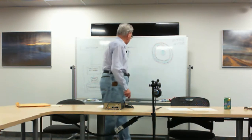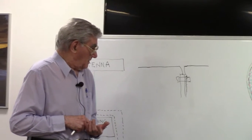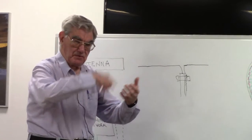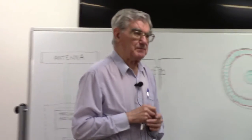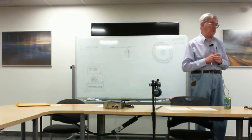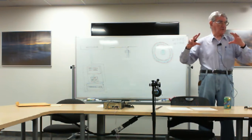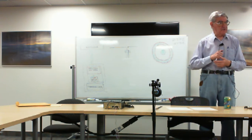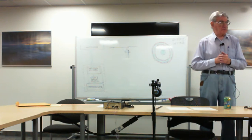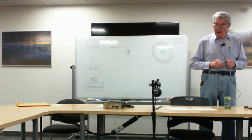Make a coil for your choke. Oh, make a coil of coax. Yeah. Another way of achieving the same effect is just simply with a coil of, say, 5 or 6 turns of coaxial cable. As a matter of fact, there was a beam made by Cushcraft, I think, a 40-meter beam, that actually used a coil. It was visible in the photographs. I don't think there were more than maybe about 2 turns. Yeah. Well, that was it. It was basically a choke balun, a different kind of choke balun that just used some coaxial cable.